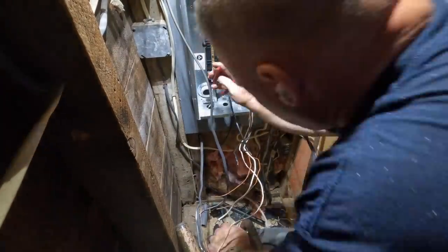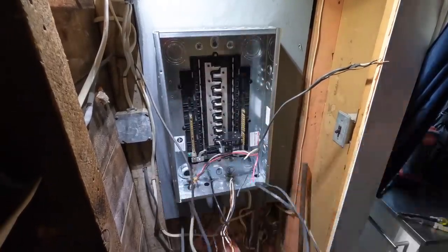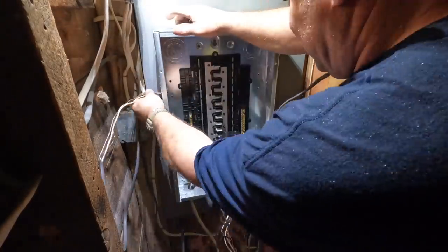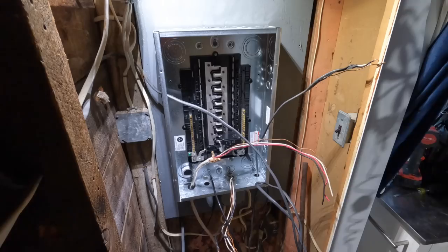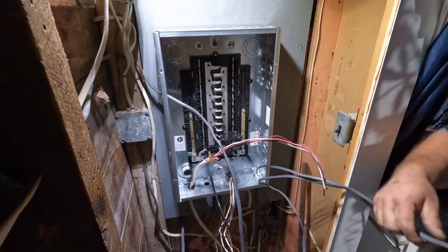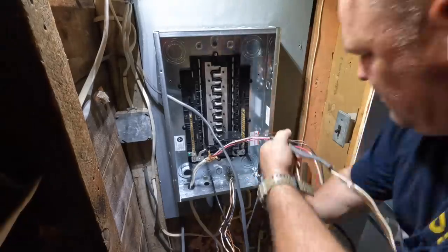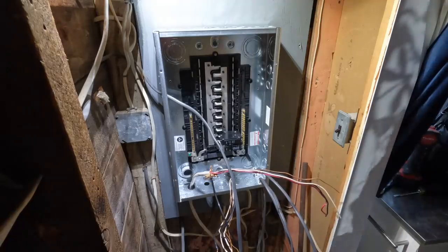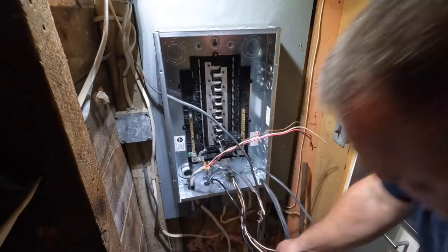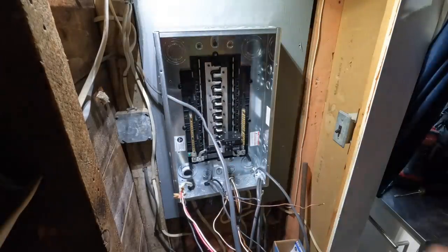But what allows me to keep it like this and not have to move that water heater or relocate the electrical panel is the NJ Rehab subcode. New Jersey is unique because what New Jersey uses is the Uniform Construction Code, and then it adopts the whole National Electrical Code and deletes certain code sections of the code book that are unique to New Jersey. And one of those things that's unique to New Jersey is there are a lot of old houses where wiring not only needs to be updated, but so does the electrical equipment. And so the NJ Rehab code allows for the water heater to remain where it is, for the panel to remain where it is, and for the service on the outside to remain where it is.